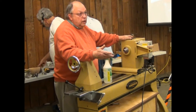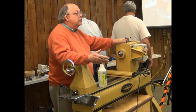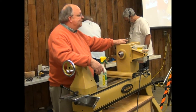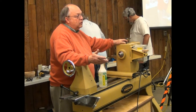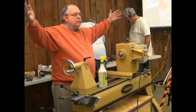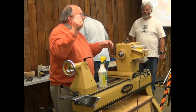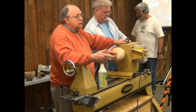I turn a lot of burl, a lot of curly maple, and getting a really clean final cut is key. At a conference in Vancouver, a guy was turning four- or five-foot-long diamond burls and he would use canola oil — applied with a big makeup mop — on the wood. It really, really helps get a final cut on burl. It works pretty well with curly maple and those kinds of things, and depending on your finish, it doesn't penetrate too deep. It really helps making a final cut so you don't have to sand as much.